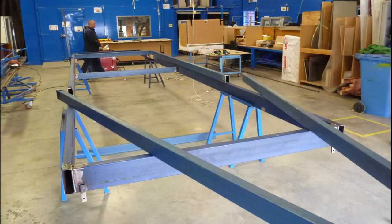Once we flipped the frame over, we put the fabrication up onto stands to achieve a good working height. Then we proceeded to lay up the second frame on top of the frame we'd already built. This was a very similar process to what was explained earlier — grinding, cleaning up the ends, taking the primer off, clamping, and measuring everything two, three, four times.